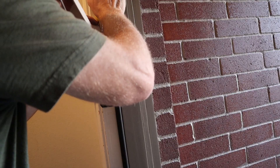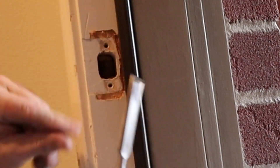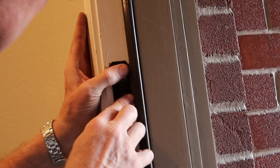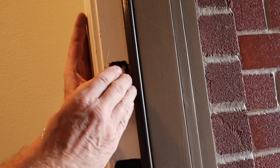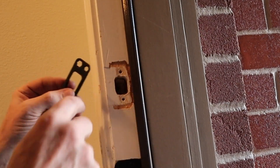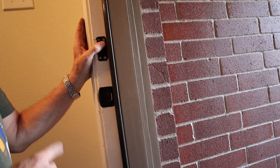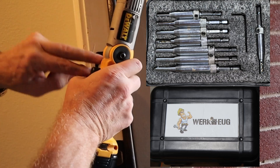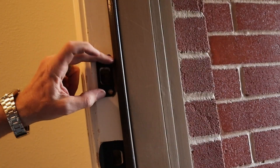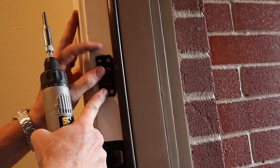This chisel is very sharp — I do not want to cut my weather stripping. It's right in there. It's not completely flush, but there's enough gap in that door I don't need it to be. These bigger holes are for the longer screws, and that's supposed to go towards the jamb. I think I'll drill a little pilot hole and sink these. I've got these WORX centering drill bits — they work real nice. I'm going to do the smaller holes first, actually get the screws put in those, then come back and do the bigger holes.